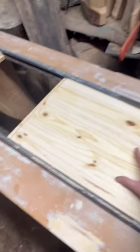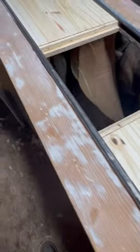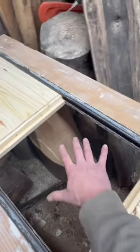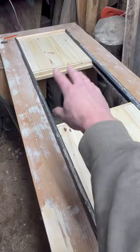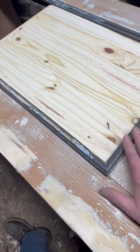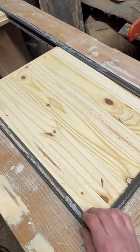This had a big glass pane in each door and they didn't like that — they wanted to do something different, something smaller. So I measured out a height, got some safety glass, and I'm currently boxing in these windows. I'm also doing my best to reuse the original trim, reshaping the molding and stuff.